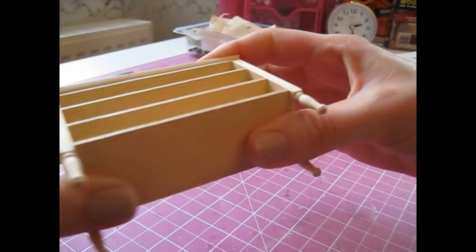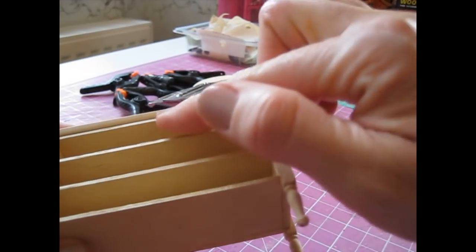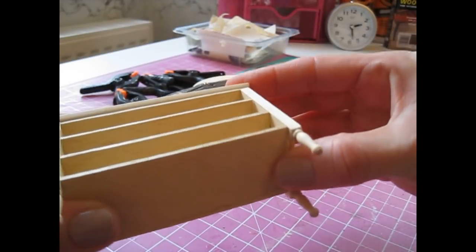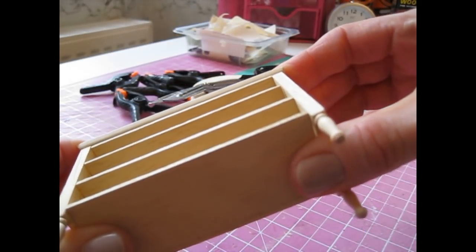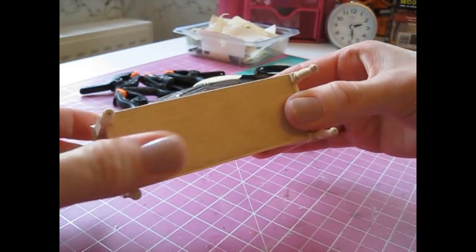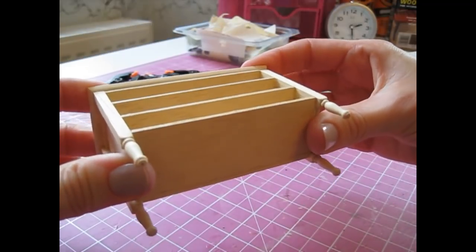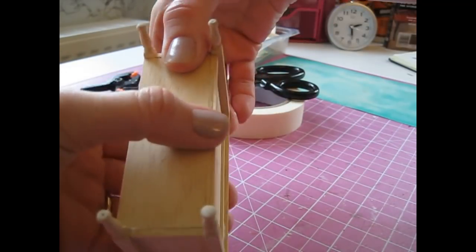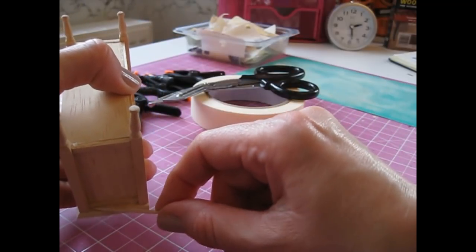Look from the front to make sure you've got an even overhang at each end — usually the thickness of the bevel we've created. You'll have that nice flowing line along the front, with the bevel coming up from the top piece. The corner of the bevel follows the line of the corner of the leg, which is something to check for. Give it a good press — I'm holding on to the supported part of the side so as not to press on the unsupported section. Remove excess glue around all those edges.